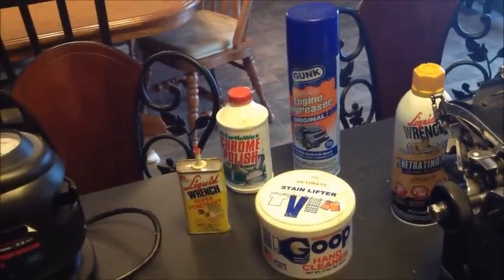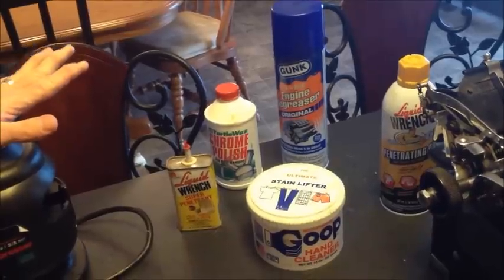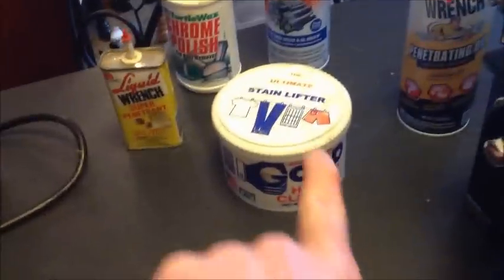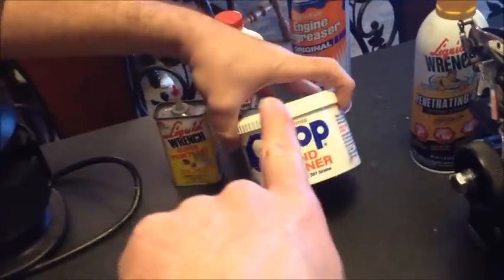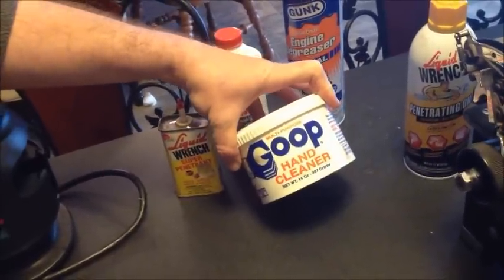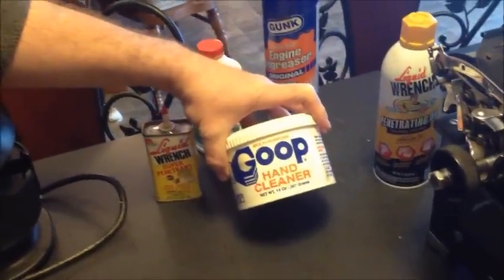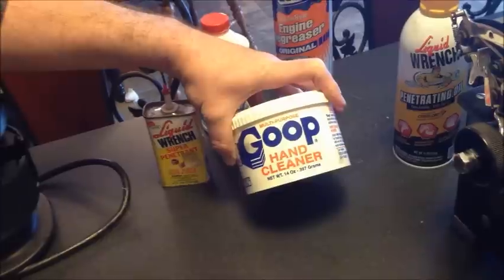I mean, I don't recommend that. It certainly will be clean. We have to talk about the difference between filthy and grungy versus something you could probably have near your kitchen and not barf. You definitely want to keep that away from any of the rubber on the machine. This does pretty well on some finishes. With a little water and either a paper towel or a soft sponge, you can get a lot of grime off a typewriter without damaging it. This does really well at dissolving petroleum-based things. You want to try it on a completely inconspicuous spot on the back of the typewriter first, just to make sure it's not going to affect the old layer of varnish on top.